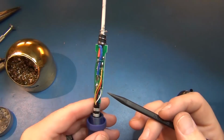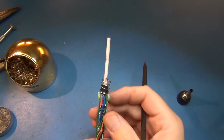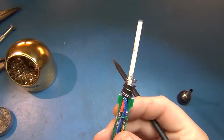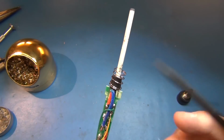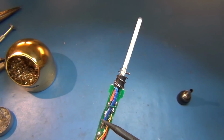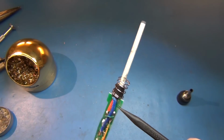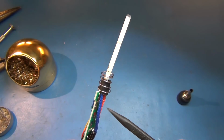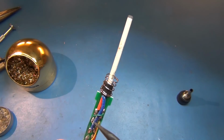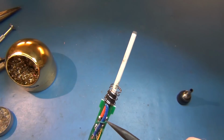So we're inside of the CSI Premier 75W soldering wand, pencil iron, and the wiring is very much the same. It's also a fiberglass board with about the same quality soldering. It's got almost the same wires. It's got two wires for the heaters, which are going to be, in this case, in blue, and two wires for the temperature sensor in red. This high temperature shielding, because it goes up into the ceramic heater.